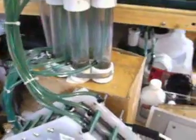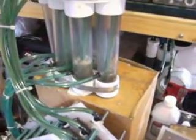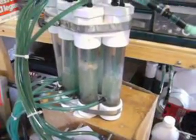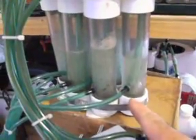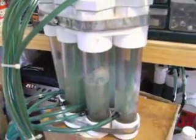I'm going to crank this thing up to 25 amps and give you a chance to see what happens when the cell cranks up. I haven't flushed the electrolyte in this, so there are some floaties in there — this is essentially the original electrolyte; I haven't flushed this cell yet. This is the one I used for the genset test videos. The blue tubing is where the gas outlet comes down at the bottom and bubbles up through. On startup I'll get a little bit of foam, but that foam's going to go away.